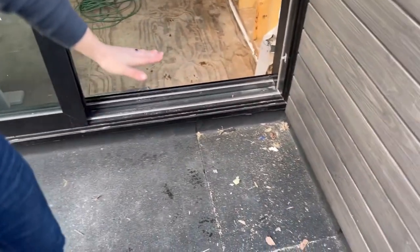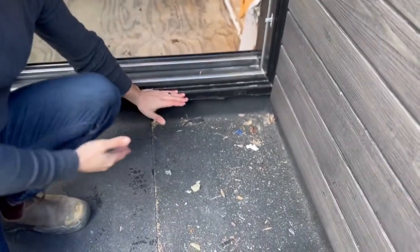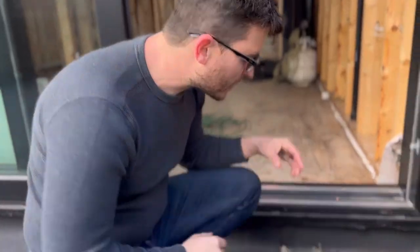Here's what we're dealing with. We have about six inches. Normally a deck would be framed with a minimum of a two by eight joist. In this case, we don't even have the seven and a quarter inches we would need to use a two by eight joist. We have six inches exactly, so we need to frame with something less.